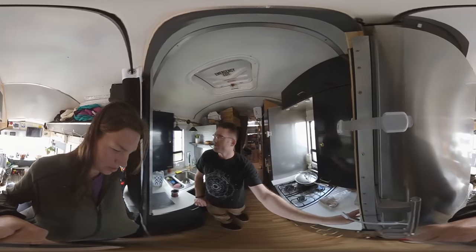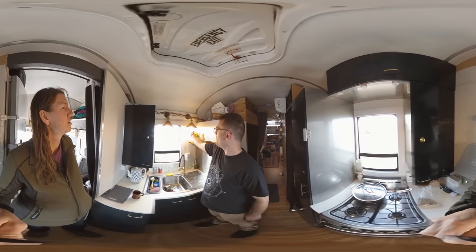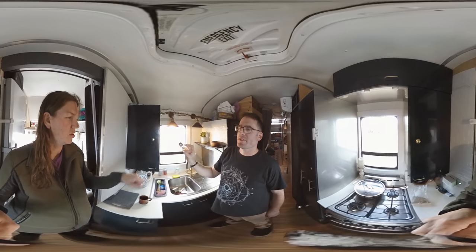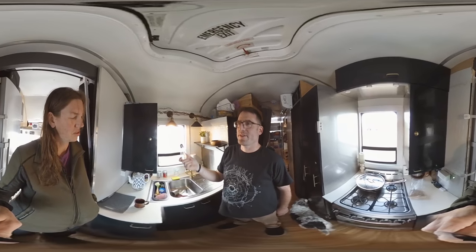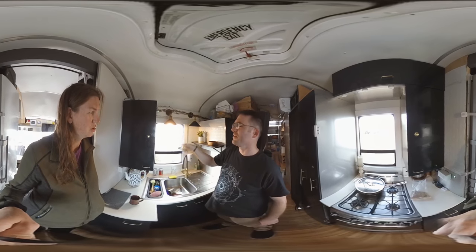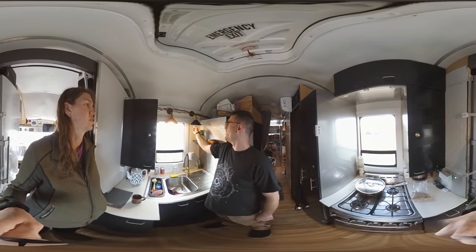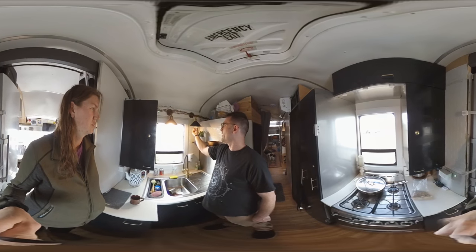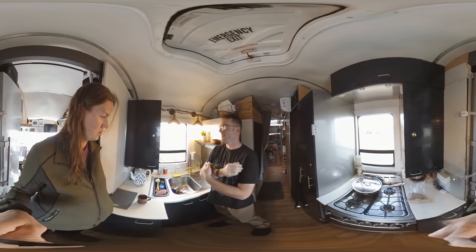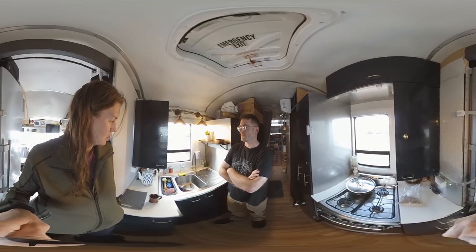So this is our kitchen. I really like these light bulbs — they look like Edison bulbs. They're actually 12-volt LED ones. So these aren't 120-volt; they're just 12-volt with a little power converter in them. I just used a 120-volt fixture, but it's all 12-volt still. There's a whole set of bulbs you can get on Amazon — 12-volt something — and they have all the different fixture and light bulb types, but they're all 12-volt systems.